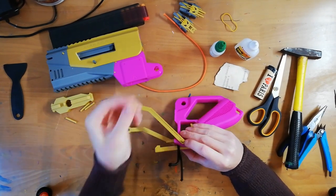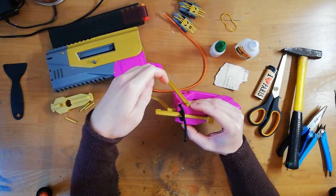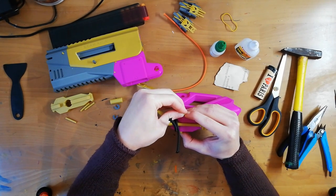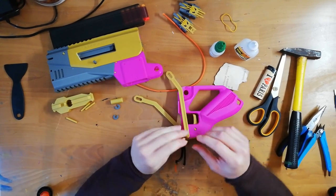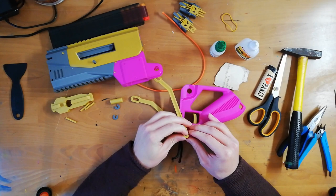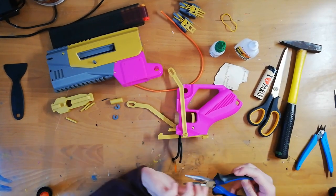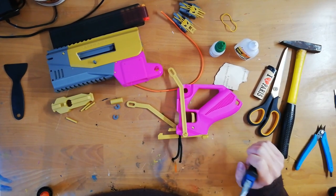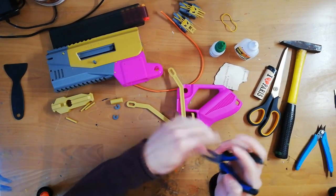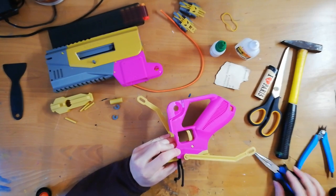The other priming arm, and then we take these security rings. The parts with the T ends have little notches in the front — that's where the ring will engage. They should go in relatively easily. It should hold fairly securely. If your rings won't slide on easily, you can try making them out of PETG which gives them a little more flex, or you can take pliers and hold the pin and the top of the ring and squeeze it together to get enough leverage to close them.